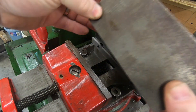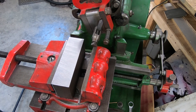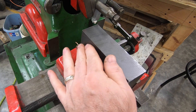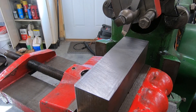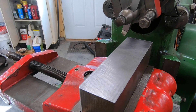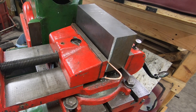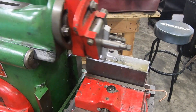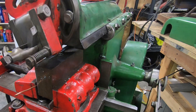I was going to start with this side, but the side that would have been in the movable jaw was bandsaw cut and is not even remotely square. So my best option is to lower the shaper table and get this rough sawn edge cleaned up and squarish so we can use it as our reference. I'm going to start off with probably a 20 thousandths depth of cut — my only interest here is to get this surface clean and flat. I'll worry about the overall dimension when I machine the opposite side. For these roughing passes I like to set a pretty healthy step over, about 12 thousandths of an inch.